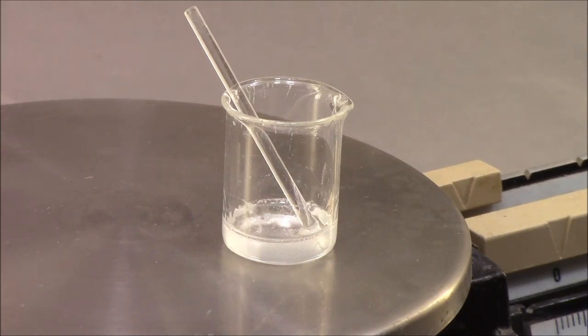Because sometimes I'll use Hxtal as a fill on a glass object, and instead of filling a crack, I'll fill a chip. I basically sit it in the hot box so that the filled portion of the object is at a level orientation, and I fill that with Hxtal and just let gravity do my work for me. And then a couple of days, that's pretty darn strong. I can add more to it by then if I have to, until I get that void filled. But 5 to 7 days for a full cure on this at room temperature. 1 to 3 days roughly with heat added to it.